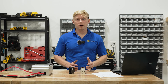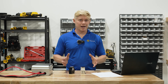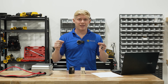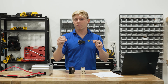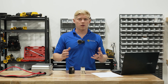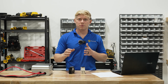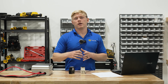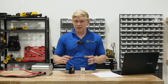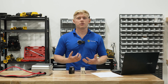The next question we get a lot is: what type of breaker do I need? If you go to Home Depot and pick up an Eaton or a Schneider breaker meant for AC current, it's not going to work for this application. AC current travels in a sine wave, so 120 times every second it's crossing the point where there's no current traveling — it goes back and forth. So alternating current will kind of extinguish its own arc. When you have DC current, it's constantly traveling in the same direction. As soon as you throw the circuit breaker, it has a very hard time disconnecting that DC current and creates an arc inside the breaker. The breaker extinguishes that arc using a magnet to suck it out. In an AC breaker, there's no such magnet to extinguish the arc because it doesn't need that.